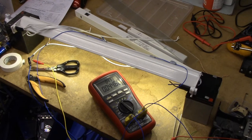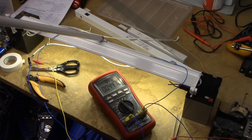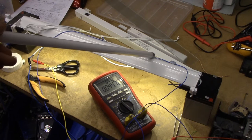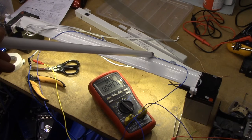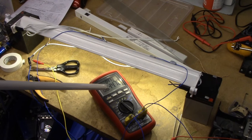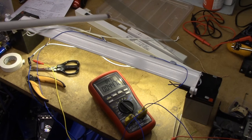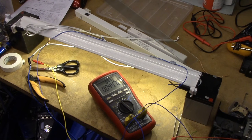After being left to bake for about an hour or so, everything's stabilised really nicely. We're probing temperatures at the middle LED, which is one of the lower power ones, and one of the outer ones, which is running at a third more power. We're getting 41 degrees Celsius for the middle one and 44.7 for the outer one. Those are pretty okay temps in my book. Perhaps I could even drive them a bit harder if I wanted to, but I'm going for longevity with this build, so I think I'm quite happy with this.